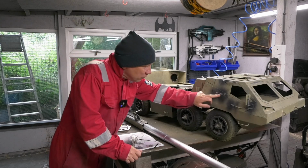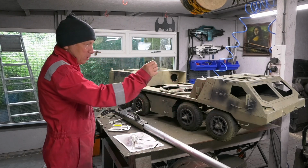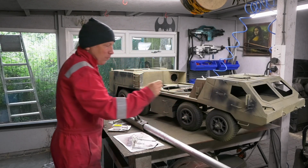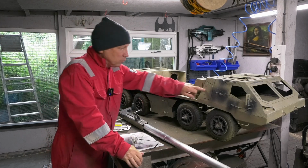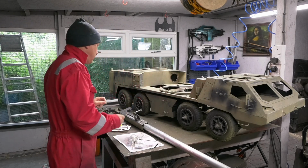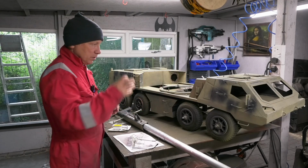There's a few dark spots because where I've got the handles here, I've finished them off a little bit with a little angle grinder, just to get the edges better. It's very difficult sometimes to weld these tiny little pieces onto quite thick metal, so sometimes the finish isn't great, so I've had to finish that off with a little grinder and make it look good. And then obviously give it a coat of etch primer just to let it bond in.